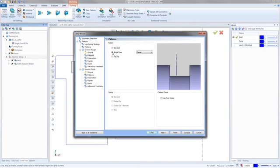Now, if you ever had a custom groove tool that you wanted to just go in, cut into the part, and then leave, just one pass straight in and straight out, that's what you'll use the single pass for. Depending on where you set up your origin on the part, not the origin, the theoretical touch off point, that theoretical tip, you'll have to choose whether you want to center it, go to the beginning, or go to the end of that cut.